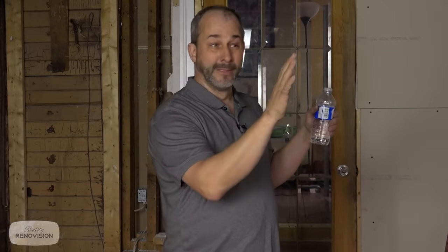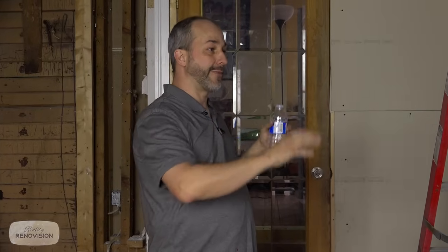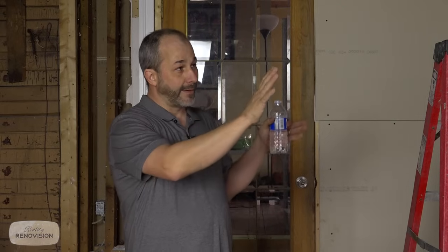But in some areas, like in my bathroom, I've actually reframed the entire wall inside the old wall because my foundation is so thick. I'm trying to bring my insulation level in line with what it is in the crawl space. So that gets me a lot closer. It also allows me to plumb it off. So I have a nice plumb wall. Everything in that bathroom is going to be needing plumb and square. So I'm plumbed in a brand new wall.